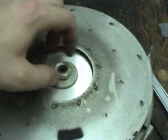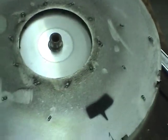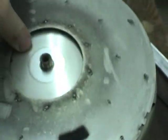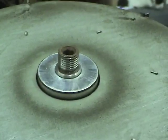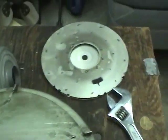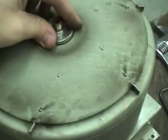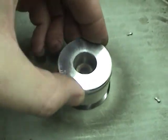Here comes off the first blade — nut, washer. Nice big, probably half-inch shaft there. Pretty big hub, about an inch and a quarter or so. Nice pattern from the dust in the back of that too. I'm numbering everything as it comes off so it goes back on in the same order. Here the spacer comes out, and there's the next blade — looks similar.